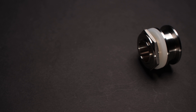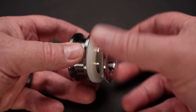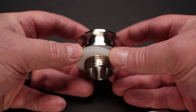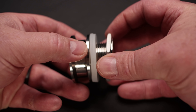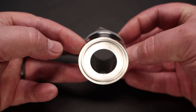For the connection to the kettle, you're going to need a bulkhead — and I actually found a specific one I kind of bought on accident for something else, but when I started putting this together it worked really, really well. It is an inch-and-a-half tri-clamp bulkhead, and something different about this one is it uses a really thick silicone o-ring, which is like the same size as the entire diameter of the bulkhead. That allows it to give you a little bit of forgiveness to attach it to the top of the lid. When you attach it, make sure everything is centered and the nut is tightened down as much as possible — make sure you use the flat side of the nut, not the side with the ridge, or it won't tighten down all the way.